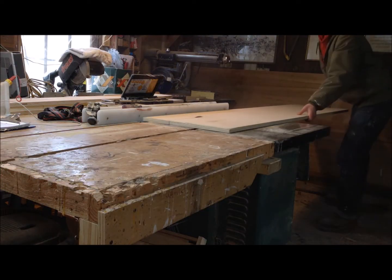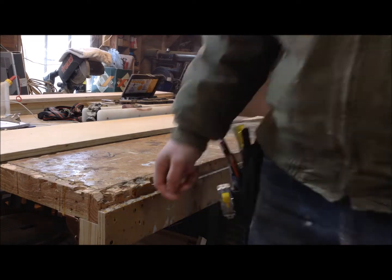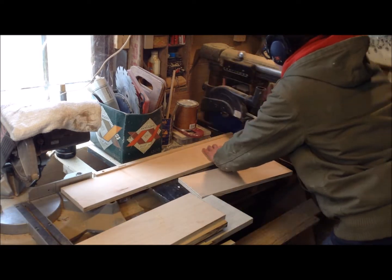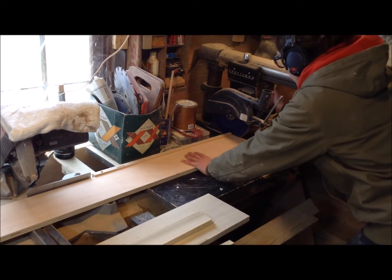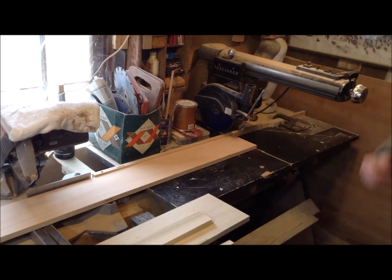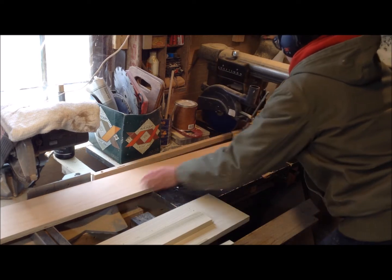The first part of the process for this video is going to be breaking down some three-quarter inch birch veneer ply to make the drawer boxes for the cabinet. I have other more in-depth videos on my channel showing how I prefer to make drawers and how to mount things with European style hinges — links are in the description box. I use three-quarter inch ply because it's something I always have on hand, usually scrap left over from the cabinet I'm building, and it's compatible with my dovetail jig.